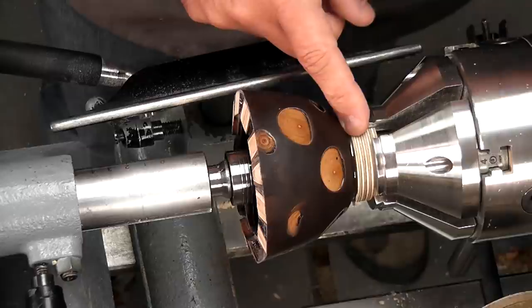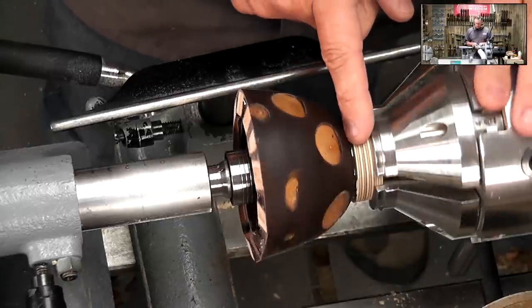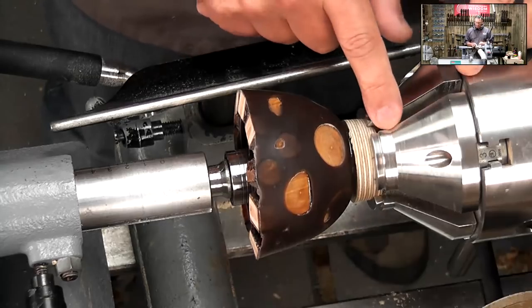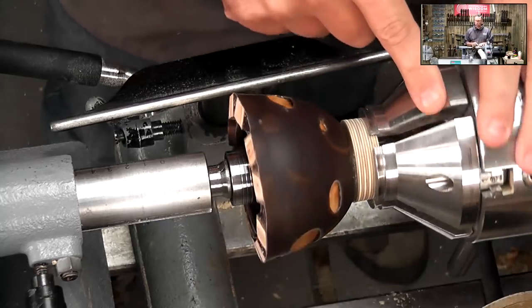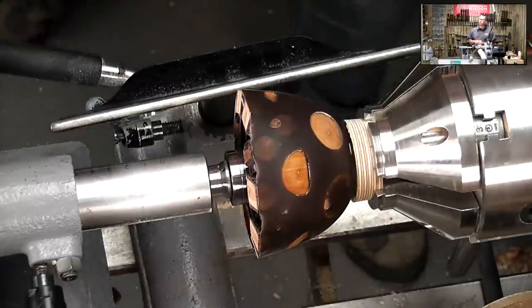The timber's a little bit softer. You've got gray in a weak spot, as it were, running through. So all I've done is epoxy resin that on, turned it true, and then it's held in my O'Donnell jaws, the 112 O'Donnell jaws.